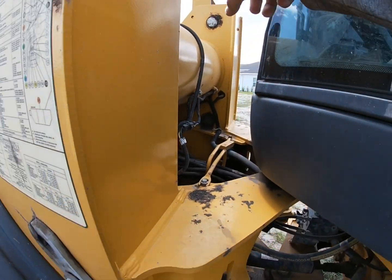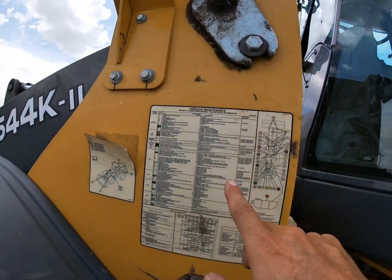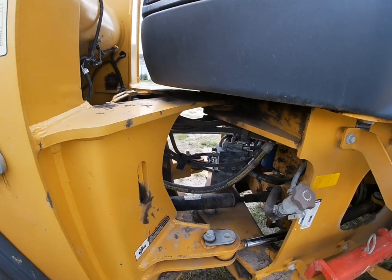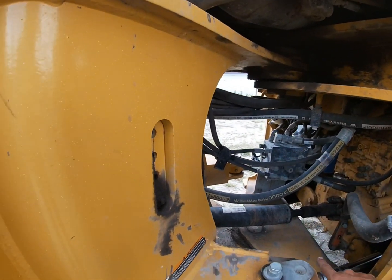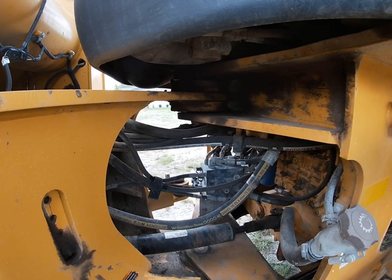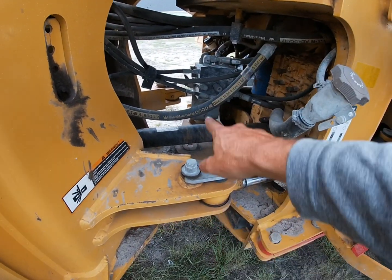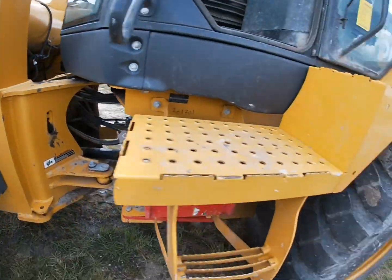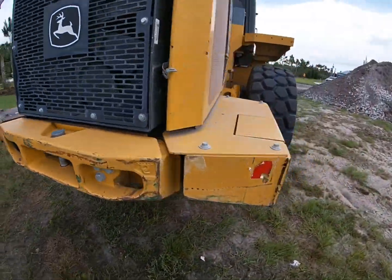Same thing on the other side — one on the top, one on the bottom. One is for the main arm and the other one is for the hydraulic ram. Then the bottom of the ram here. Coming to the center of the loader, we're going to have a grease point at both of the connections here — the center pin and the center pin. We're also going to have grease points at all of the hydraulic ends, front and back.